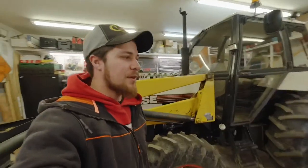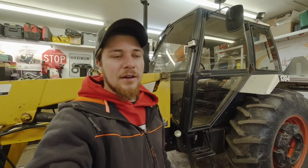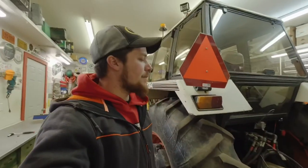So I think that's going to conclude today's video. We've got the Case 1394 loader tractor in the shop — it'll warm up here tonight. We're going to drill and tap those holes, mark the location for the 12-volt power source and cell phone holder. Then I'll get some paint tomorrow morning before I come out to the farm, paint that, and get it mounted. Thanks for watching today guys — if you tune in tomorrow we'll complete this project.